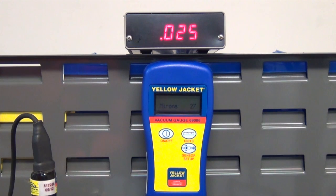The next time, your rate of rise should be much slower. You'll do this a few more times until the rate of rise has decreased and your micron readings have leveled off and remain stable for several minutes.